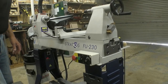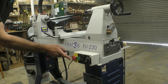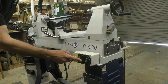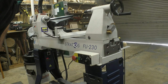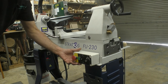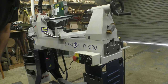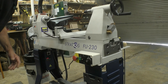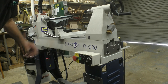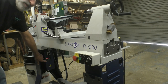Starting from this end of the lathe, what we have here is the control box which has the on switch and a large emergency stop switch. This switch here is for reverse and forward so you can actually sand in reverse should you so wish, and this is the variable speed controller. This is magnetic — it comes with a little shelf that you can put on if you wish. I've got used to over the years having this on my left hand, though I move it when turning bigger stuff so I don't have to go into the line of fire to turn it on and off.